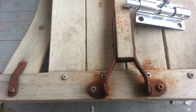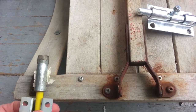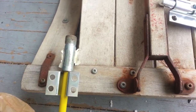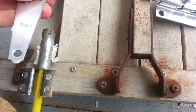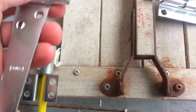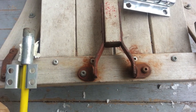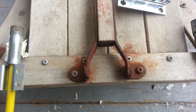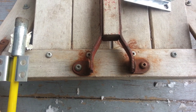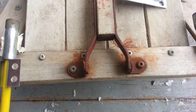Instead, this will be fixed onto that piece of wood — my two hinges. The piece of wood that's holding this in place would be facing us on the top. The hinge will go on that piece of wood, on the other side from this thing, and the hinge would be screwed on there. With the right screws and the right wood, that's going to be really sturdy. I've got a woodworking friend — I'm going to ask him what kind of wood would be best. You're going to have to pre-drill it so that you don't crack the piece. I've got one-inch screws here, so I'm pretty confident in that end of things.